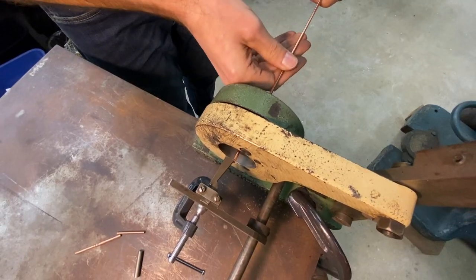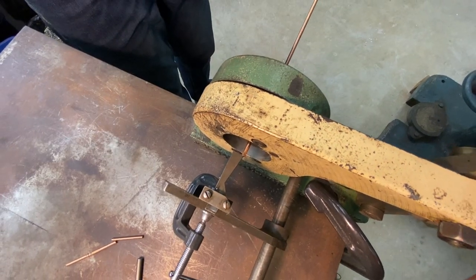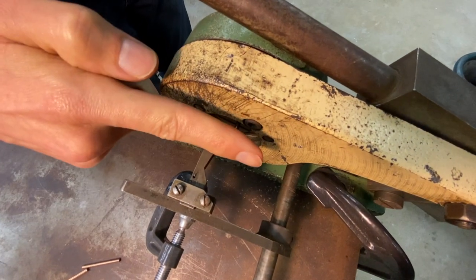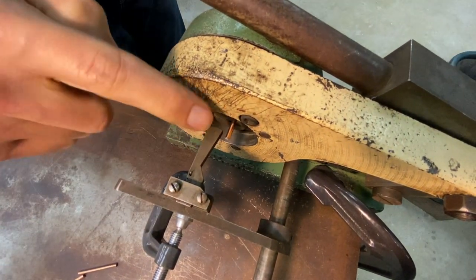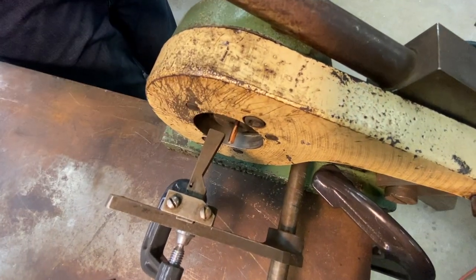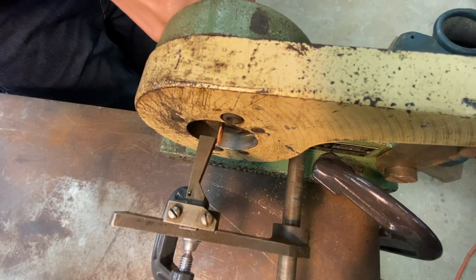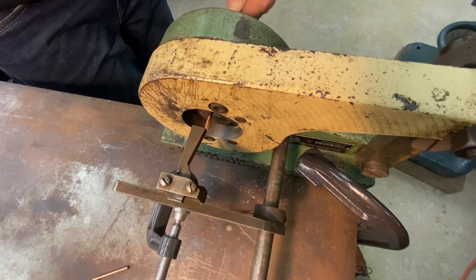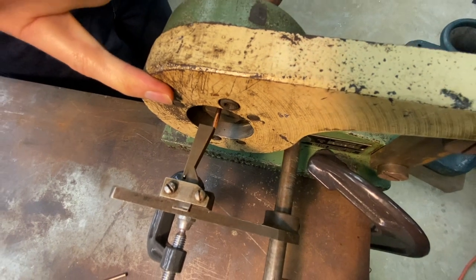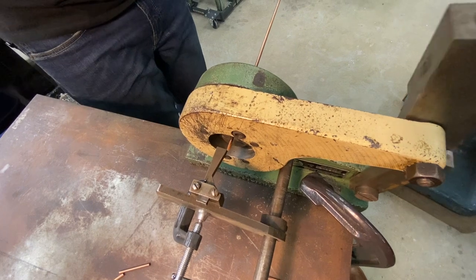When you push the material against it, the spring pushes the block over to a stop, and then you pull the handle to cut it off. The die rotating moves the stock forward and allows that stop to pop back. So now it's back to the beginning of its spring range, right? So then when you push the handle back on the machine, that lip catches the material, and when you push the bar in farther, it pops the part out while also giving you that stop back to set the next part on. So you literally just have to push on your stock.